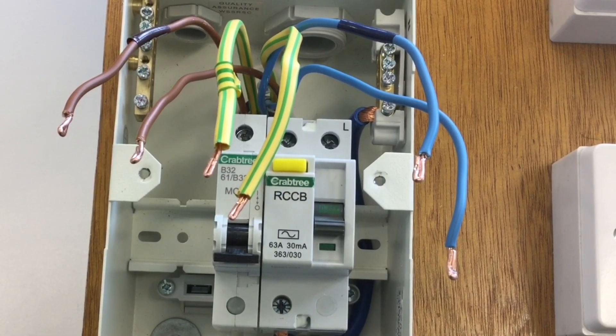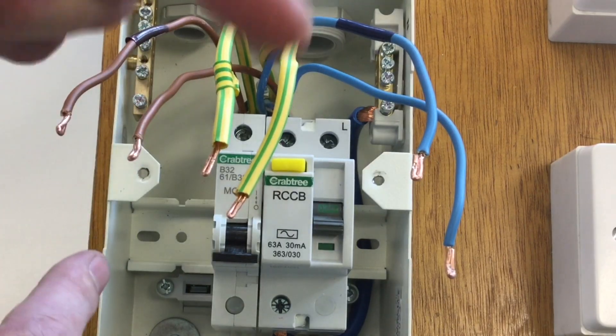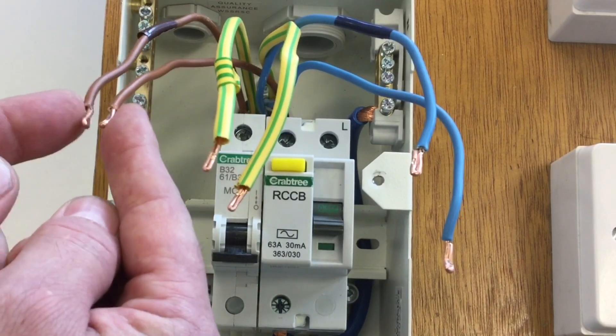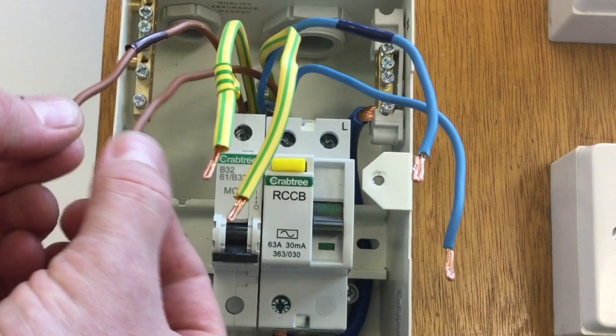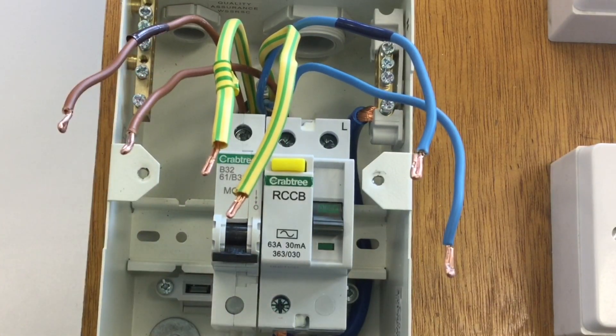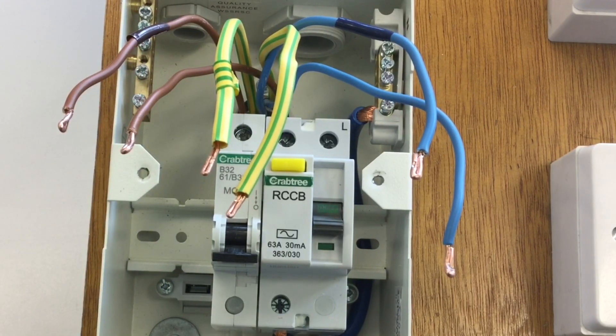We're going to use a divide by 4 calculation for stages 2 and 3. When we measured end-to-end, the conductors were disconnected, but in circuit they're joined together in the same termination. Therefore they're effectively twice as big — doubling a cable's size halves its resistance. Also, measuring end-to-end means going out and back, but when joined in circuit we halve the length, which also halves the resistance. Half the resistance from double size, times half the resistance from half the length, gives a quarter — and mathematically we find a quarter by dividing by 4.